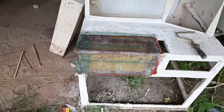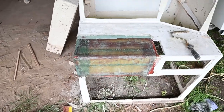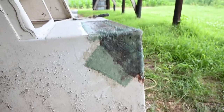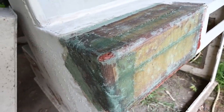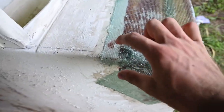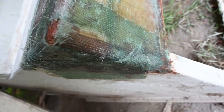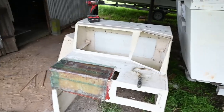I'm pretty stoked with how this turned out. Look at it right there. Over here it obviously doesn't look crazy good, but I'm pretty happy with it. I'll fair this after I sand it. I actually had a really nice corner going all up and down until I put this last piece on right here - probably didn't need to put it on, or at least could have cut it off. But I can come back and grind that down and fair it, and I'll be able to make this look pretty damn good for adding a whole piece. That is the console - I'm pretty stoked. Mind you, I still have to flip it over and do the underside, but that's not as critical as the top side. I don't care if it looks bad on the other side.